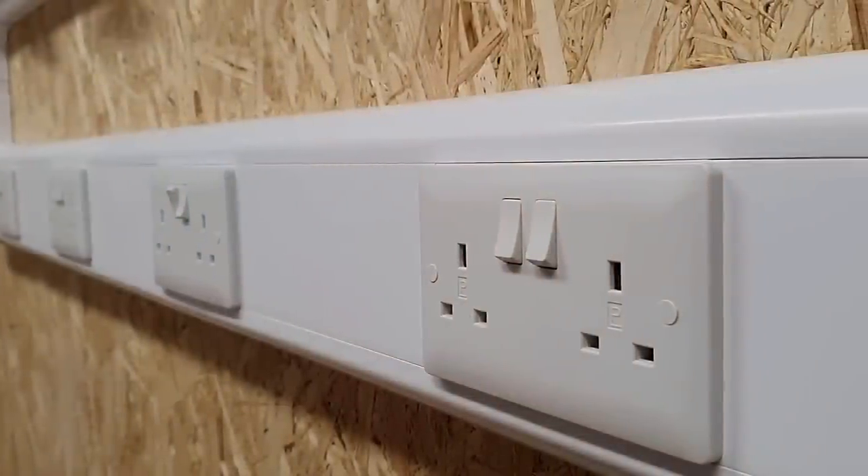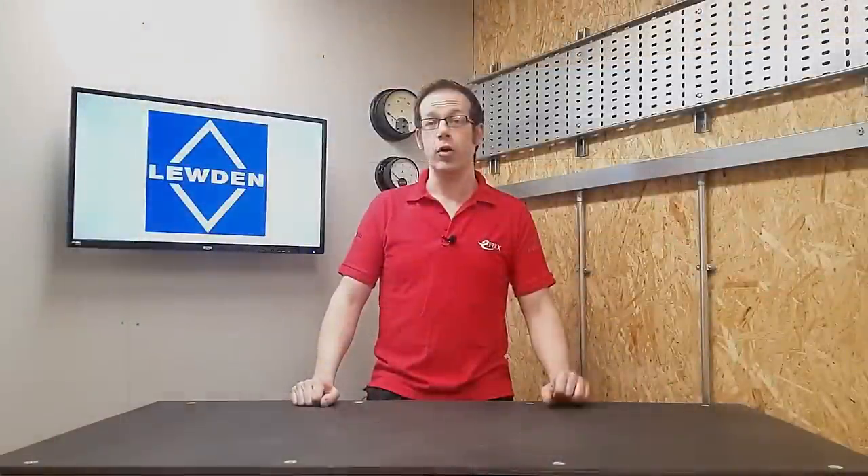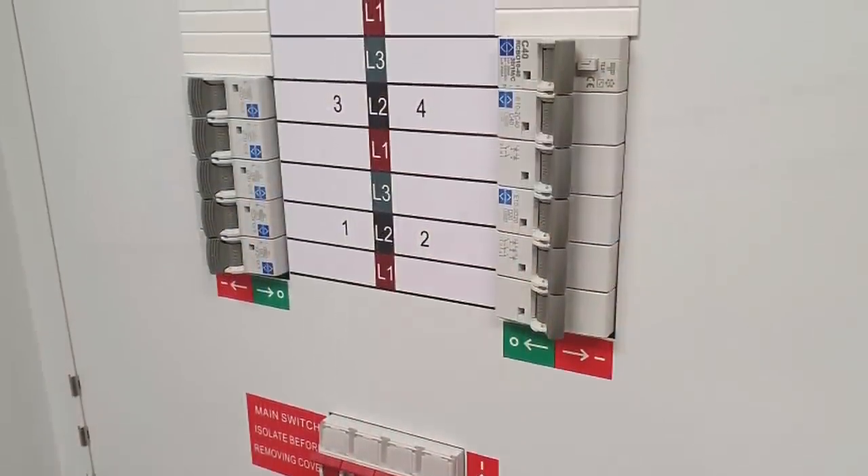So what's likely to cause this overheating of a conductor? Well, there are a couple of main ways. The first is that the circuit could become overloaded by having too many loads connected. This isn't likely to happen for every circuit — a lighting circuit with a fixed number of fittings is never likely to become overloaded. However, it is possible for a circuit feeding socket outlets, as it's difficult to predict exactly what will be plugged in, or on a distribution circuit with lots of smaller circuits connected. If too many loads are connected, too much current can flow through the conductors, causing overheating.